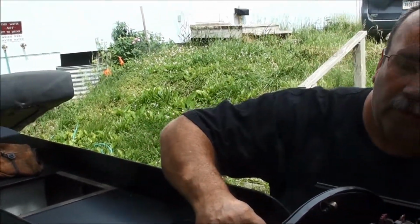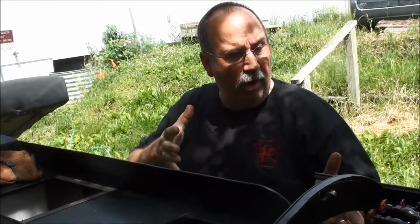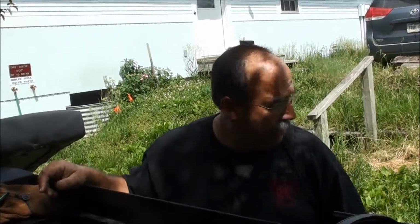So is it like the oxygen scavenger and all that stuff that people talk about? Just keeps everything floating, in suspension. And the main thing is, if you're going to run for a weekend, you're going to put water in this boiler and you're not going to take it out until the end of the weekend. You don't blow it down each night. Keep it filled up, and it'll come back down as it cools, fire up again, and like 1/4 teaspoon in the tank in the morning. That's good enough. Do you start with a teaspoon in the boiler? Quarter teaspoon. In the boiler? Yep.